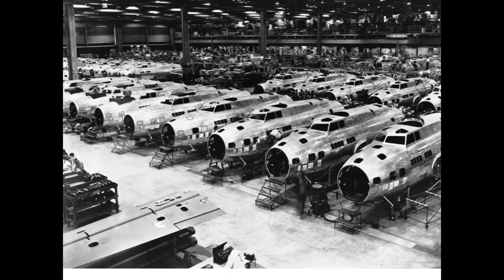Non-clad or bare aluminum will have a dull appearance, will not be as corrosion resistant, but will be about 10% stronger and is adopted where additional strength is required. Some of the corrosion reduction of bare aluminum can be mitigated by an anodized conversion coating process. Some of the B-17 wing doubler reinforced panels are bare aluminum.